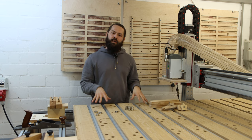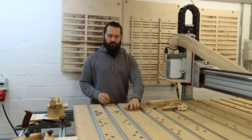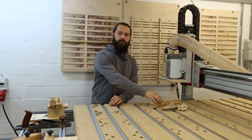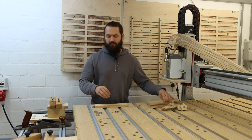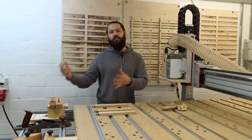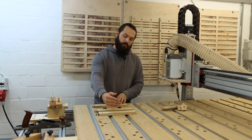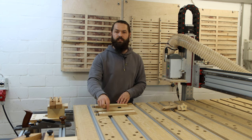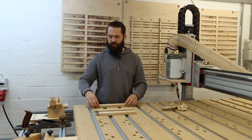You might have wondered why I went with such an elaborate spoilboard. Now, the dog holes, for example, let me position multiple work pieces at the same time. Here, the bench dogs ensure the work pieces are square to the machine axis. And I also know in digital space where they are, so I can now machine multiple work pieces at the same time, for example drilling holes in precise locations, without swapping out after every single work piece was routed by the CNC.